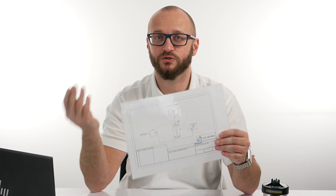If you've got third-party controls on your unit, you will also receive a third-party wiring drawing. This tells us where the contactor kit goes so we can switch a third-party pump if we need to. It's also really important that you follow this, because they can work on zero-volt switching, which means we switch the neutral. So if we're putting any live wires where they shouldn't be, we can quite easily damage the PCB in the outdoor unit. So make sure you follow your schematic.